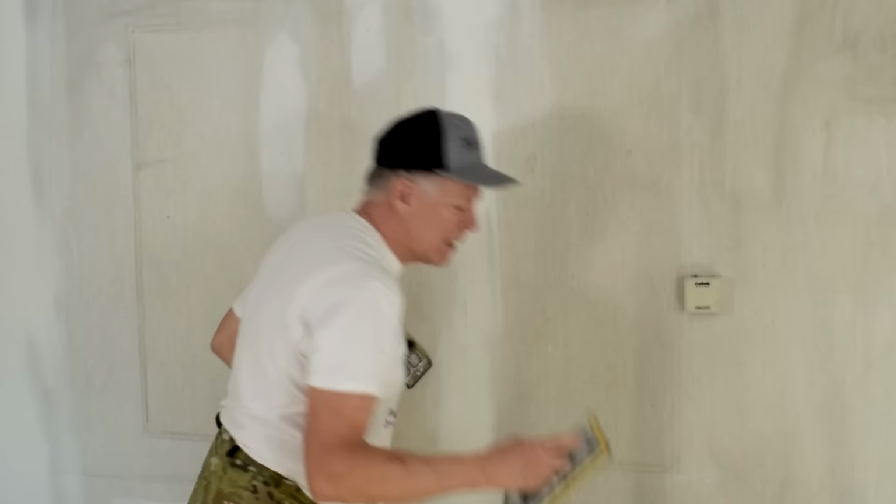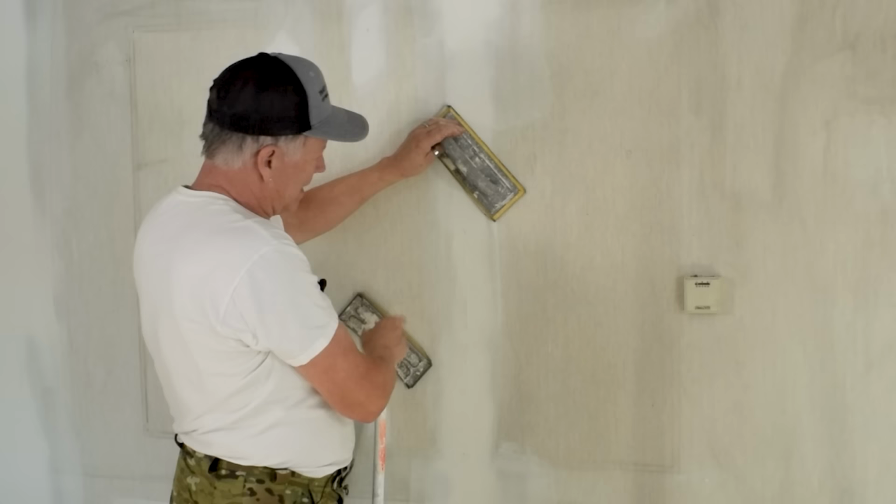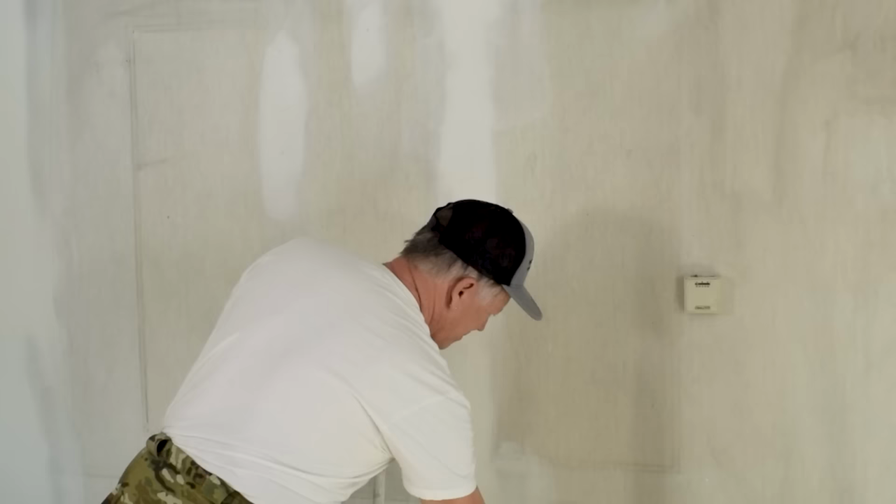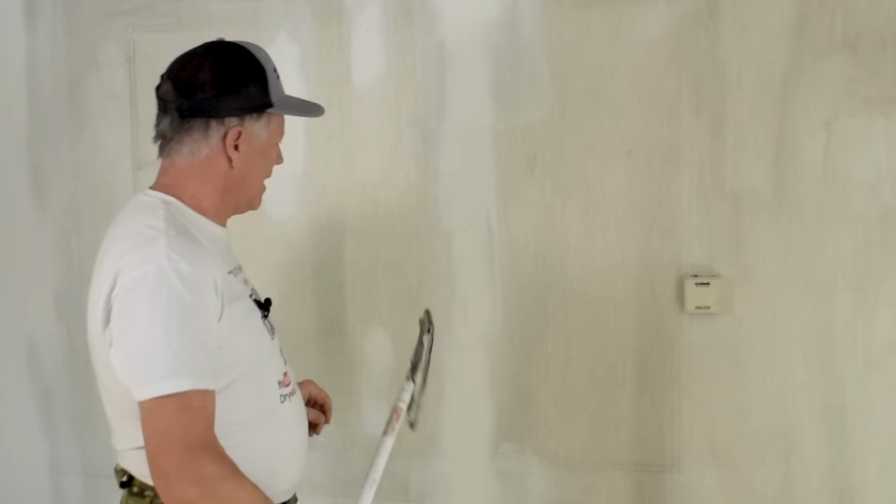Another option, a cheaper method, is a hand sander. If you're just doing a little bit, these will work great. And run them kind of sideways, even these. If you run any sander like this, that edge will leave grooves in what you're sanding. So just brush sand it. So do it with a pole real quickly, really. Like that is about all you need. Again, if you didn't put it on too heavy, knock off the dust, then we're ready to coat it.